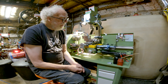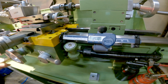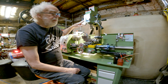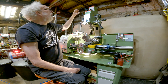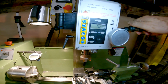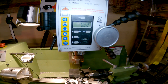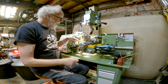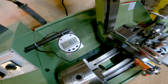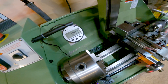I've used a company called Lin, who make a DRO that just slides backwards and forwards with a micrometer — excellent. The Z axis actually comes with a DRO on the mill, but it's really hard to see, so I added a little light. As you move the mill head down — either grossly or with the fine feed — it's pretty accurate. For the Y axis, I've added a small DRO on the left-hand side of the cross slide, which was pretty easy to do.